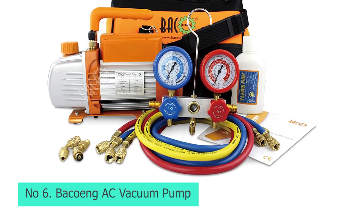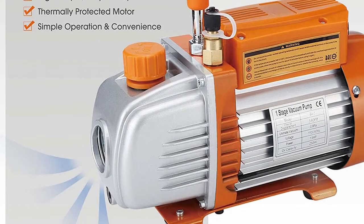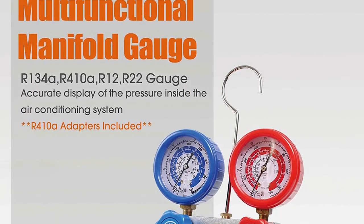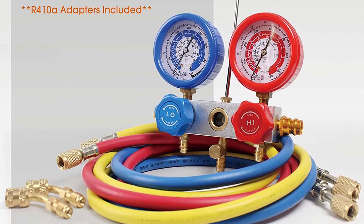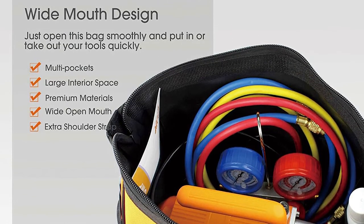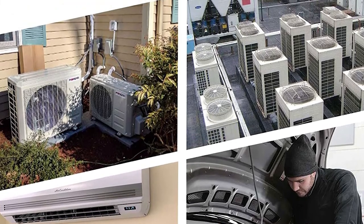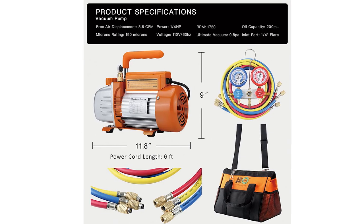Number 6: Baecoing AC Vacuum Pump. Baecoing is a relatively small brand, but it manufactures durable AC vacuum pumps that are right at the top when it comes to performance and reliability. Baecoing's AC vacuum pump has a horsepower of one-quarter HP to deliver 3.6 CFM with an ultimate vacuum of 0.8 Pascals. It features a durable solid anodized aluminum black body, a high-volume cooling fan for faster heat dissipation, and thermal protection to avoid thermal failure. The pump has an oversized glass to view refrigerant flow and an aluminum alloy casing with a rubber handle. You can also get a tool bag for maximum portability, along with two 45-degree angled adapters to convert 5/16-inch vacuum ports to accept a quarter-inch gauge hose set.